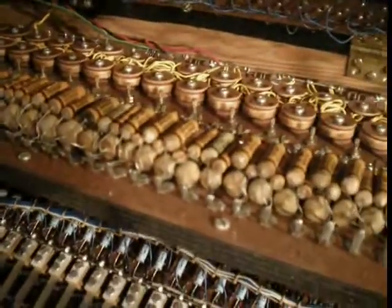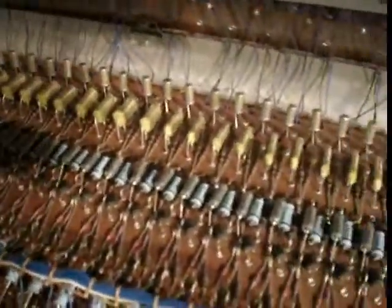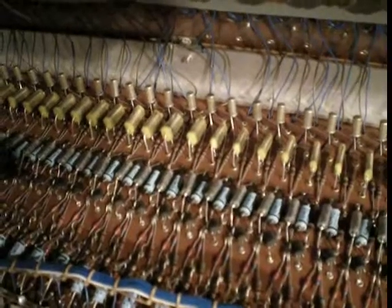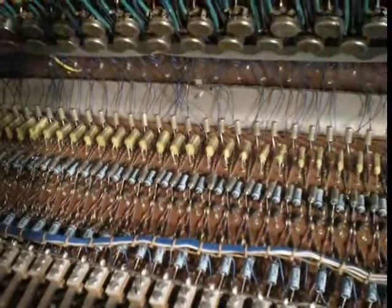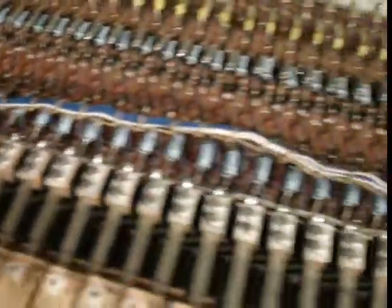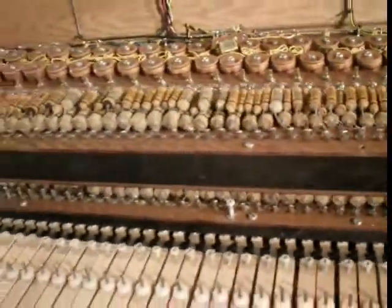Up here all you have is the coil, and these capacitors — two or three in parallel — create the exact note range needed. The potentiometer does the fine adjustment on the pitch, and that's your feed-through which goes down to the transistor circuitry. Those capacitors are all your feed-through to the transistor circuitry that amplifies the tendency of those coils to oscillate, giving you the actual signal that can be heard. These front capacitors are all measuring high ESR and should eventually be replaced. You've got the same thing underneath — same thing, only a slightly different layout.